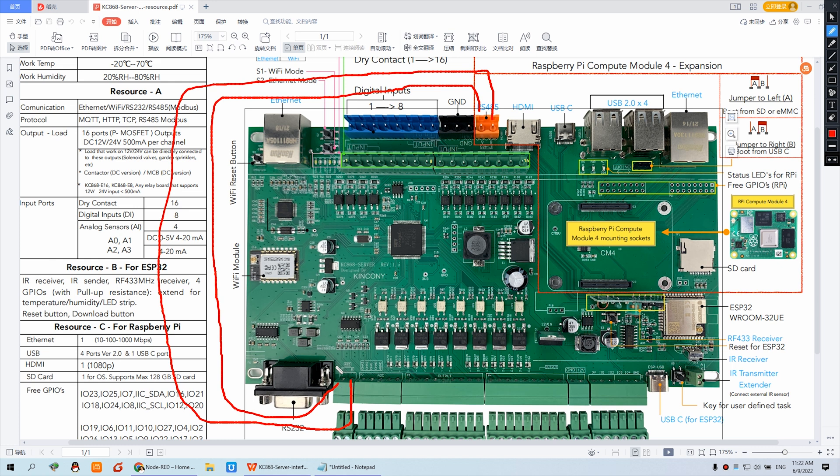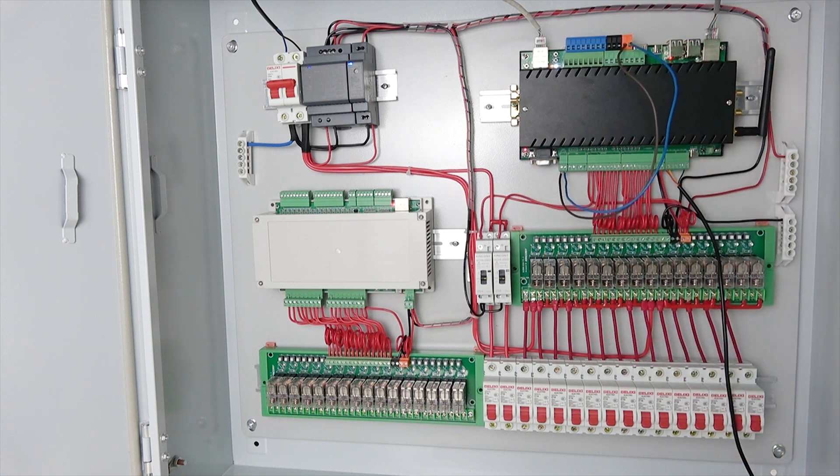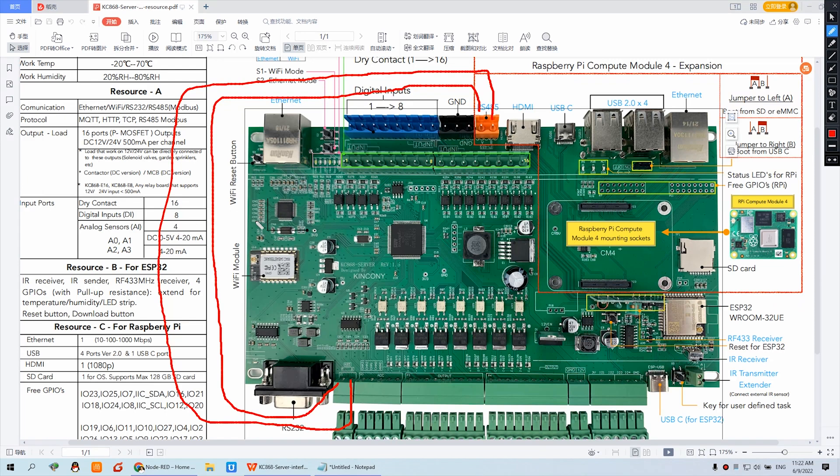You can integrate results into Node-RED by this RS-485 — here is A and this is B directly. If you have many RS-485 devices, you may have one sensor, two sensors, three sensors, four sensors, or even 100 sensors. You can connect them all together on this RS-485 bus. That will be very useful. You can see device one, device two, device three, device four — you can integrate many devices to this interface.